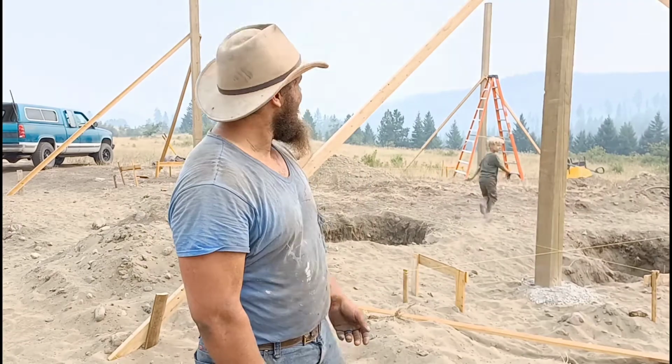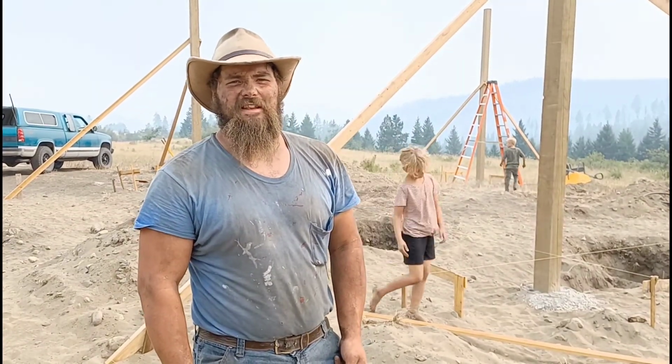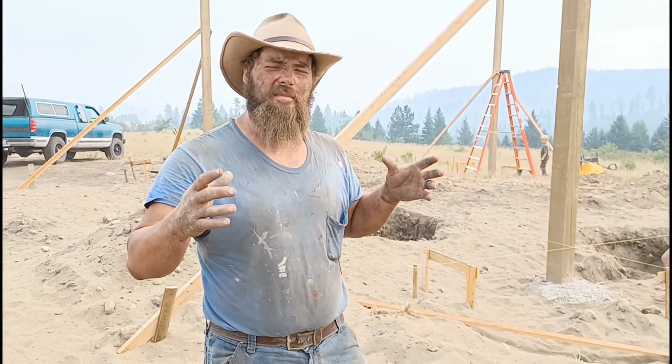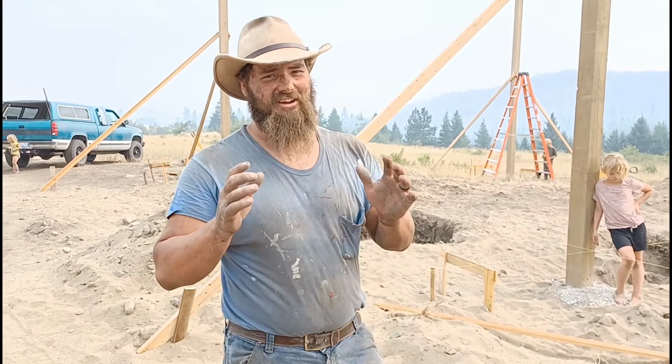We've been working hard on our pole barn construction, and Dree and I spent the morning, and Aubrey, and we got all the corner posts in. So we got our corner posts set, so we got all our exterior dimensions, so we can restring our lines off that. We got it square. We were an 1/8 inch out of square, so we decided to call it good.